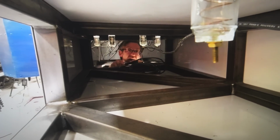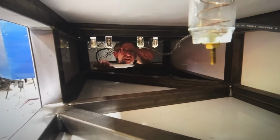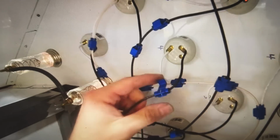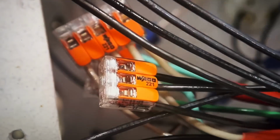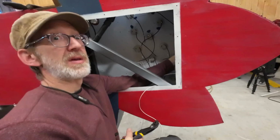In this little clip, you could see Wesley wiring up the terminals where the neon will drop into. And he also wires up the rolling lights into a box which distributes the pulses to make the lights roll. And here you can see him wiring up the lights into the transformer, and that's the roll box. And these are the neon posts which hold the neon up in the air.